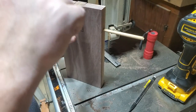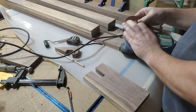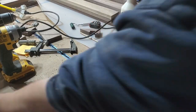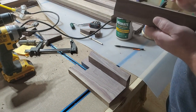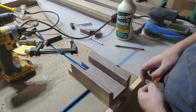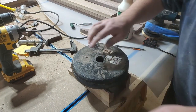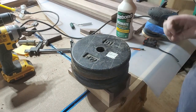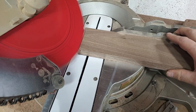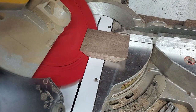After getting it right, this is how it works — should work out all right. As always, make life easier by sanding the inside pieces before you glue them all together. I cut an angle on the inside of these side pieces so that if the gate comes rolling in a little off to the left or right it'll bump it to center and line everything up perfectly. I left about a quarter inch of tolerance when the gate slides in there, so it's a quarter inch wider than the actual gate width. Now I'll work on the gate guide — a U-shaped piece of wood that mounts directly to the wall and straddles the top of the gate, guiding it across the doorway.